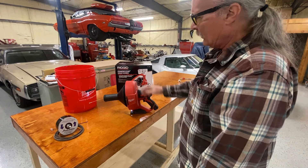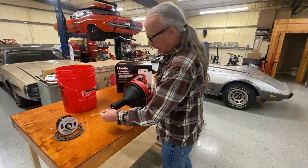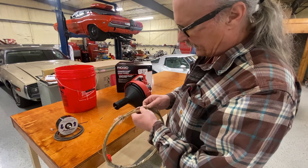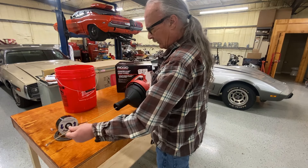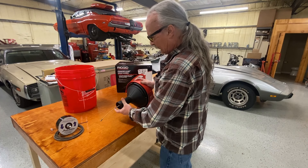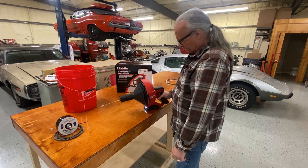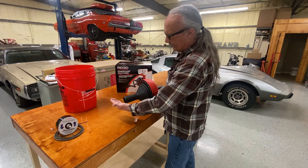The next thing I did when I started doing research is I bought this Milwaukee deal here. I really liked it and I still kind of do, but the lock doesn't lock real good on a small cable. It came with something bigger, but I can't get that to go past maybe one elbow. So I took it apart, unloaded it, and found a thinner cable, but even when you lock it you can still move it a little bit, so it won't work like it's designed to.